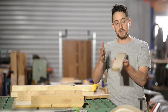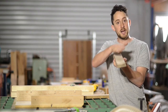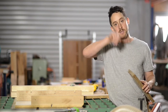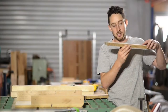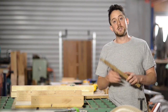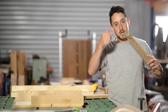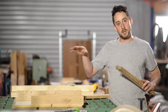My barrel has an outside diameter of roughly 300mm. The simplest way I figured out to get this internal curve is to use my 300mm table saw blade, just expose about a millimetre of that blade and push the piece of timber laterally — so sideways — along that blade. You've got to be careful when doing this; you don't want to put too much force on the blade so that you're going to bend it. Just let the teeth eat away that material as you gently push it over the blade.